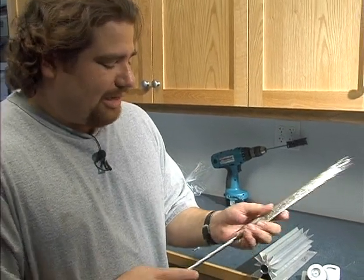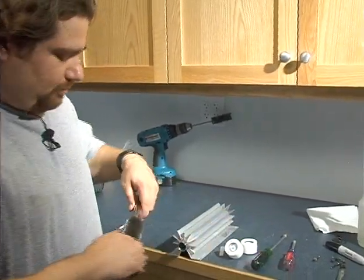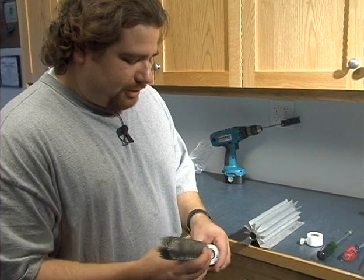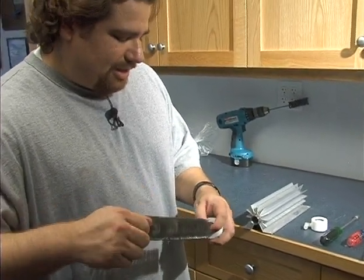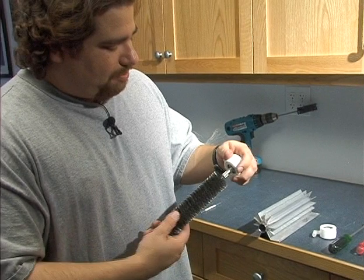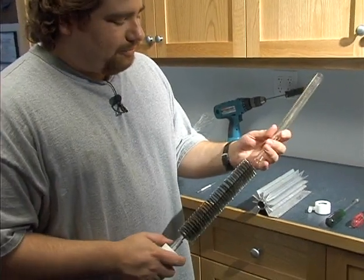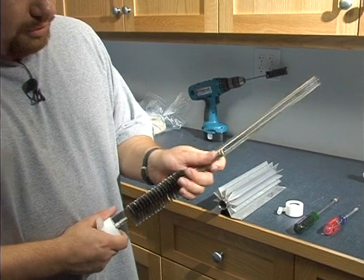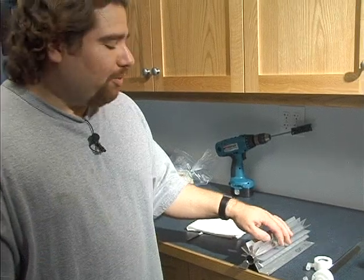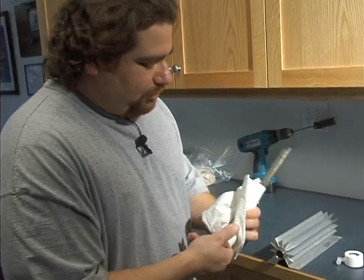We're going to push this brush out to re-anchor it to the top end cap. We're going to attach it to the top end cap. The brush does not need to be cleaned, but do inspect it for any damage along the copper wire in the interior to see if it's been unwound — though it doesn't happen too often. The dielectric glass goes back on; you'll typically fold down the brush with your hand as you feed it back on. Make sure to wipe down all areas with alcohol to remove any fingerprints.